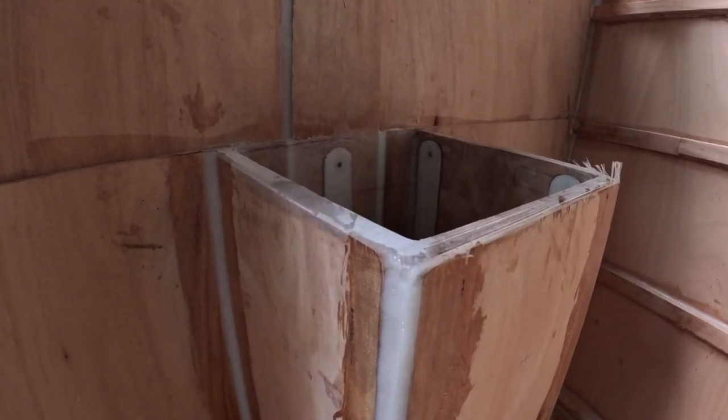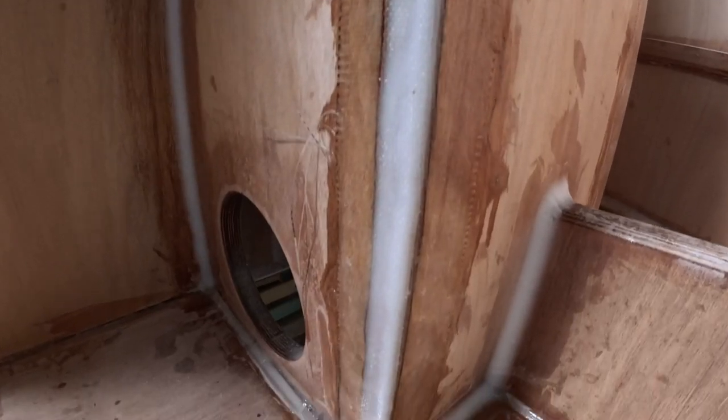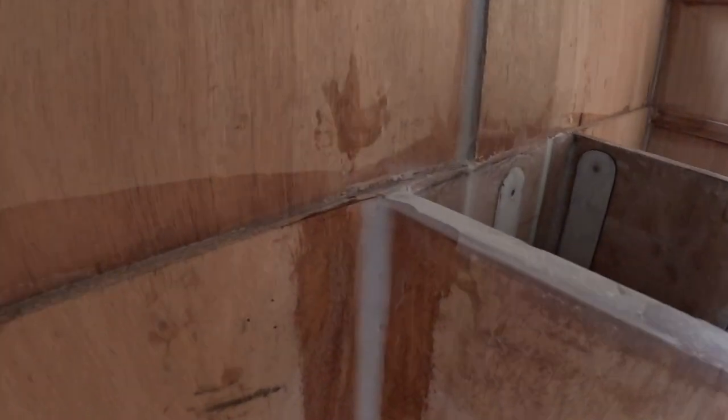One of the jobs today is reinforcing the corners of the bow thruster housing. Then I'm going to glue the skid plate on the bottom of the flange that goes on the bottom of the bow thruster itself. The bow thruster is like a vertical drawer that pushes down through the bottom of the boat and is then pulled back up into place. It has a flange on the bottom that locks into place when pulled up, and I need to put a skid plate on the bottom so it matches the profile of the rest of the skid plate — or a very fine keel — running along the bottom of the boat. Here is the fiberglass reinforcing I've done to the corners this morning; trimmed everything up, with a good fillet in the corners on both sides, which I'm about to glass.